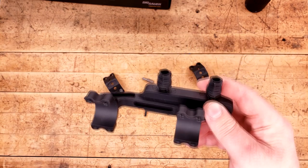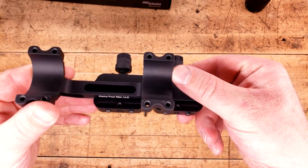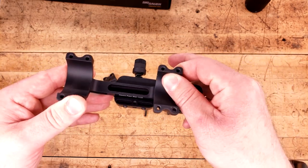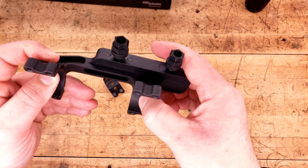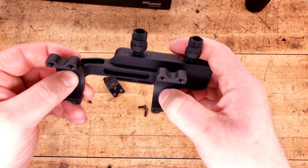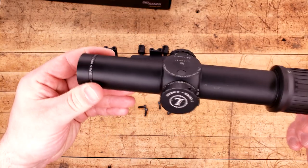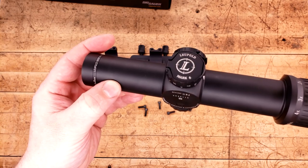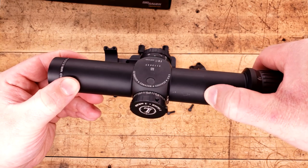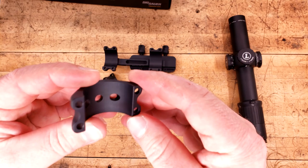It's faint, but it's there. That could just be damage maybe from an optic. But when you look at the back, you can see the exact same witness marks. Do I have to assume that it was another optic that damaged this, or is that a slight raised edge? And if I had to put money on it, I would say it's a raised edge. I can't really convey feel to you, but I do feel something. And I've been a precision machinist for a long time, and the fact that I can feel a little bit of something means that that's probably it. And if we were to look at the optic that was mounted in this — you'll get a sneak peek — you can see right there a slight witness mark that matches up, as well as right there. We can rotate this around; there are more witness marks. And even on top has a little bit of something. So all in all, the machining quality on this is a bit subpar.